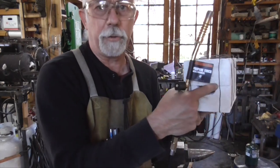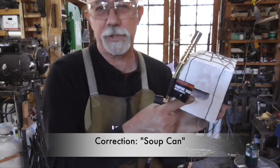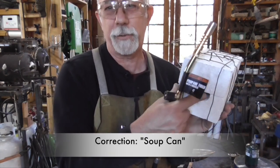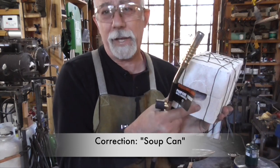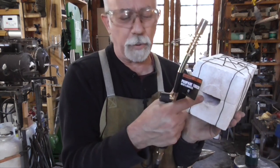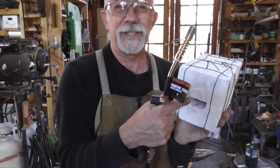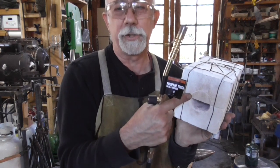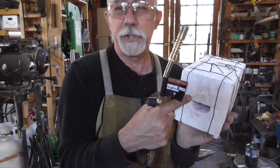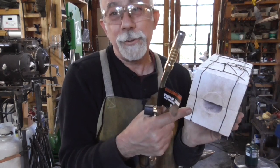This one has a two inch diameter hole cut in it. I tried one with the size of a coffee can — about a three and a half inch diameter hole — and it's too big. That one gets up to about 1,650 degrees max, which is fine for heat treating. This one goes up to about 1,900 degrees inside, which you could actually do a little forging with.